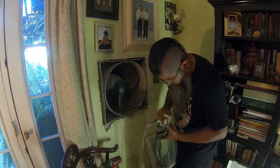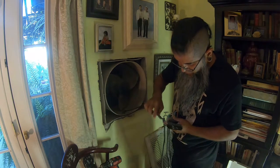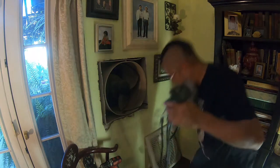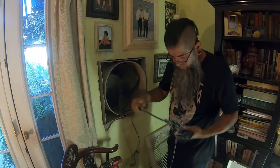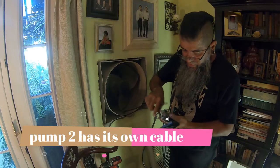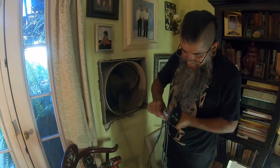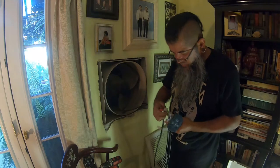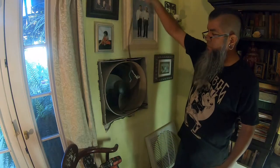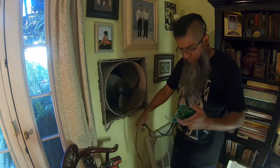I'm going to start pulling all these wires off. Green is ground — no big deal. It's easier to pull these off if you have pliers. Everything is unplugged now. You have two pumps — we don't ever use the drain pump itself, so I'm going to unplug that one too. On the board it tells you it's pump number two. Follow all the wires for it and go ahead and unplug the hot wire, which is the black one, then the green and the neutral. That's the second pump — I'm not going to use it, so I'll put it aside.